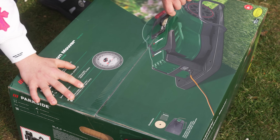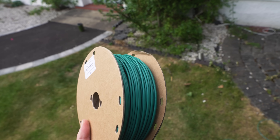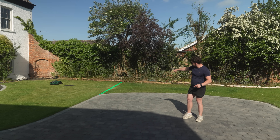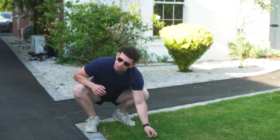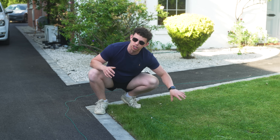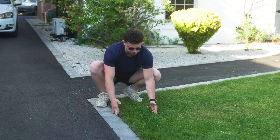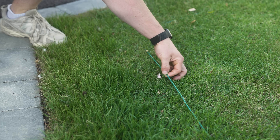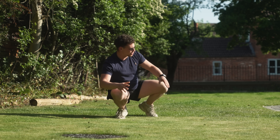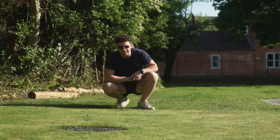When I bought this home from Lidl, I was super interested to see if it would actually work, and it's genuinely really good. In the box you get the robot mower itself, the charging base, and 500 metres of the perimeter delimiter wire — which defines the border for the robot. You can see there's a little line down here; the difference is actually crazy. This is the perimeter wire for the Lidl robot. Robots that use a perimeter wire all use it fairly differently — some go up to the wire and turn round, whereas this Lidl mower goes over the wire and then turns round. I've set it about 30 centimetres in and it's left the edge uncut, which is a great demo of how well this cheap £200 robot has cut the lawn. I am thoroughly impressed. Right here where I'm standing is the perimeter wire — what's in front of me has been cut, and what's behind me is left to be cut.